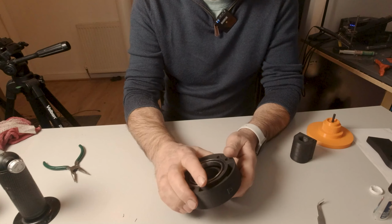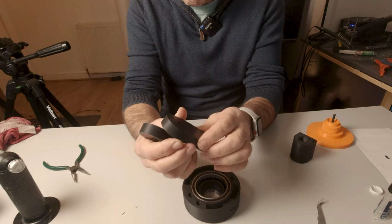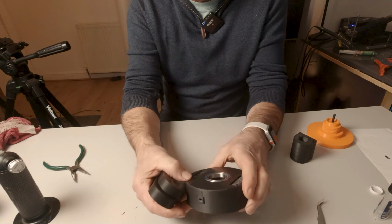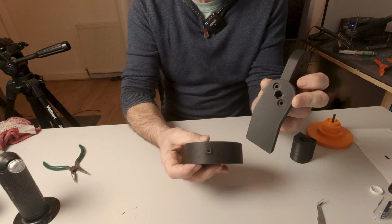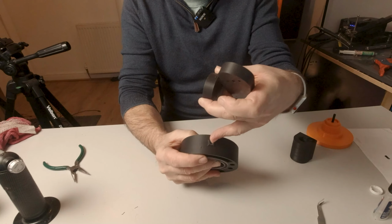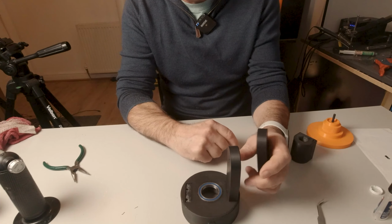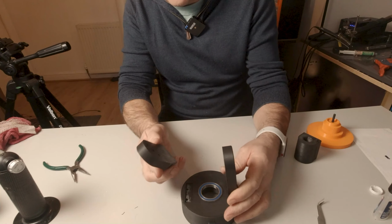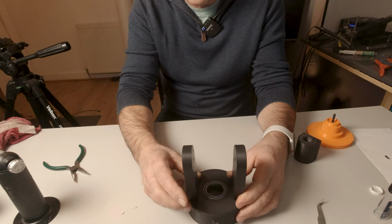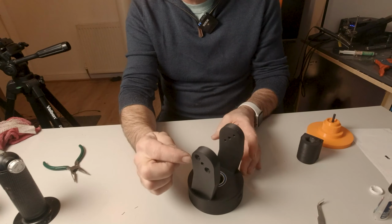Okay, the next thing to do is find parts 18 and 19. And these are our side supports, and the orientation of these is quite important. Now one of those supports has a hex on it here, and this is where we're going to have a screw locking mechanism on the end. So if that's facing away from you, the hex part is going to go on the left hand side, with the placement for the hex screw facing out the way. So that drops in there like that. And the other side is going to go in the same orientation, bending back like so. So it's important the hex is on this side and the planar one is on this side, and they both bend towards the back or the screw position, which is going to go in here.